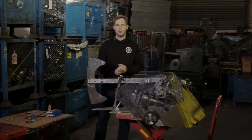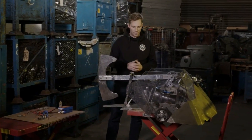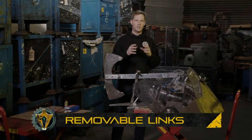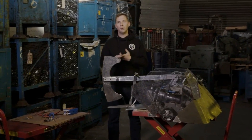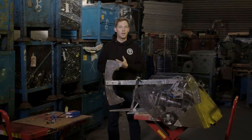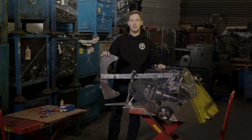Fighting robots are extremely dangerous machines, so one of the number one important safety factors is the removable link. Every robot has to have one of these. It's effectively like the switch or the key to each robot. We're going to look at what a removable link is, where it should be in the robot, how it should work, and then we'll look at Terahertz to see where they've implemented it.